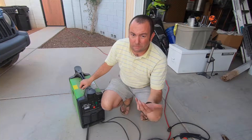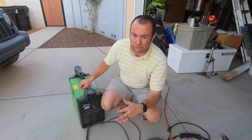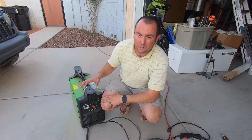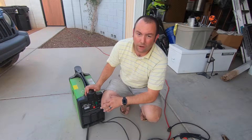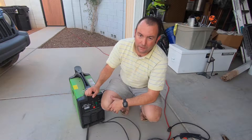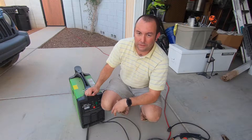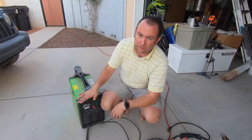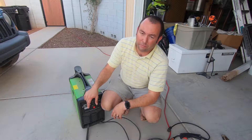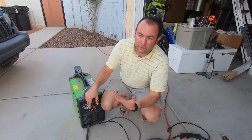So that's it guys — pretty simple. This welder is really easy to use if you're a small projects do-it-yourselfer. This is perfect for exactly what you need to do. If you're doing it professionally, you're probably going to want to invest in a nice MIG system just because it'll work better and make cleaner welds. The only disadvantage to using a flux core welder like this is it will tend to spatter quite a bit, so you just have to spend more time cleaning up after you do all of your welds.